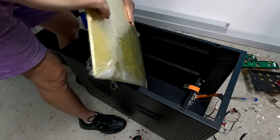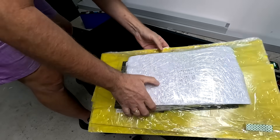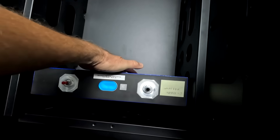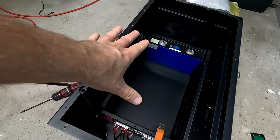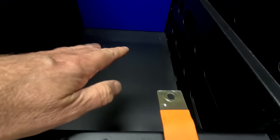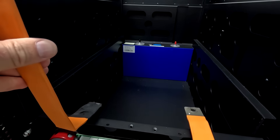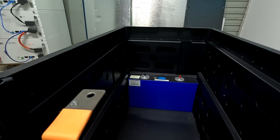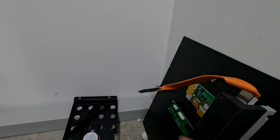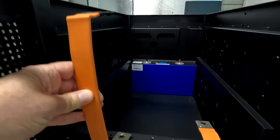This is the whole package with all the epoxy sheets and EVA tape in between the cells - look how big they are! And there you have it - access to the bottom floor. MB-56. Obviously eight batteries at the bottom and eight at the top. This connects to the main negative at the bottom row, and this other flexible bus bar connects the positive of the bottom row with the negative of the top row. Then the main positive comes from here connecting to the circuit breaker and out to the positive terminal to the outside world.